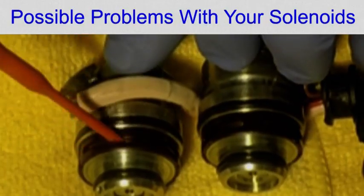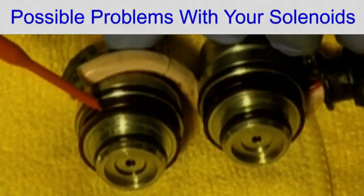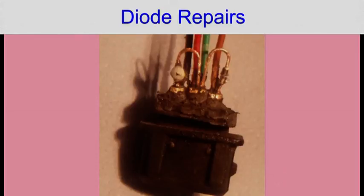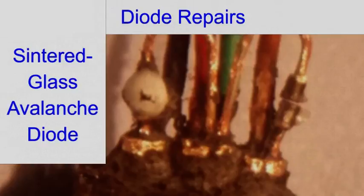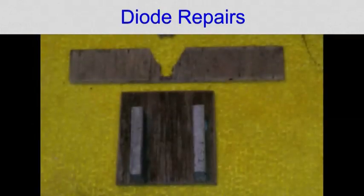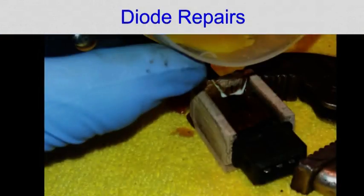These gaps were originally, when I took it apart, full of what looked like a very fine filter — but I suspect it was old engine oil. I stripped down the plug using a Dremel and found this inside. After a lot of investigation I decided the ball was a sintered glass avalanche diode. There were no markings on it, but I decided a max current of 2 amps should be enough. I soldered in a BYW32 diode and then doubled it up for extra safety for the engine management system.